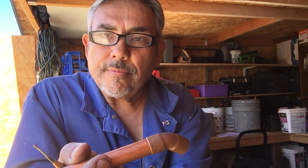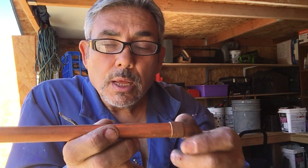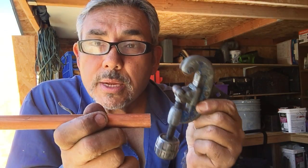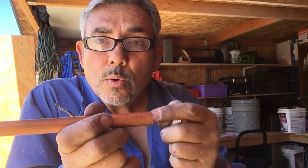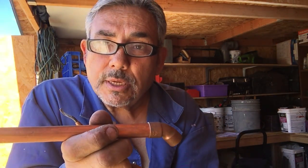When I was an apprentice, that's what they teach you — this is basic 101. If you've got some journeyman teaching you to cut copper with a hacksaw or a sawzall, he's wrong. There's a right way and a wrong way, and the copper industry tells you the right way. Apprenticeship 101: cut the pipe square with the right cutters, then ream the pipe. Now you're ready to begin your soldering process.